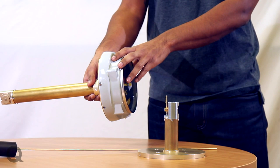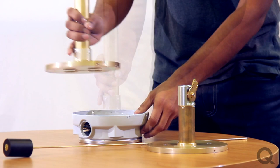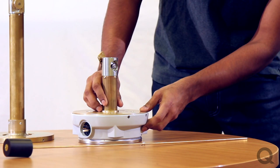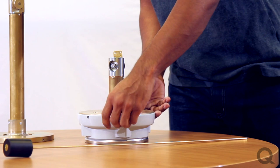The advantage of having the case assembly magnetically coupled to the flange is that it's really easy to disassemble out in the field and replace your case assembly if required. All that you need to do is take two screws out, which will allow you to easily swap out the case for another. Because these are magnetically coupled, you don't run into the risk of having to put the transformer offline or having to lower the oil level to change the case or do any maintenance work.